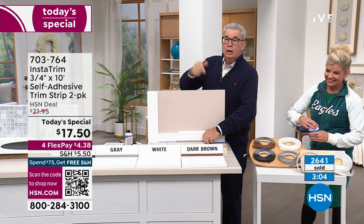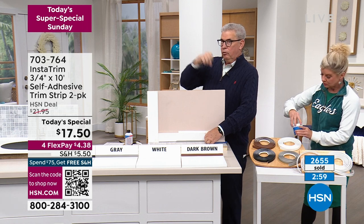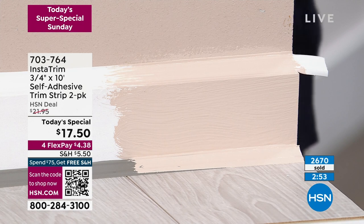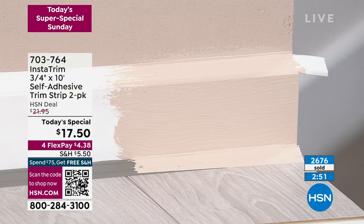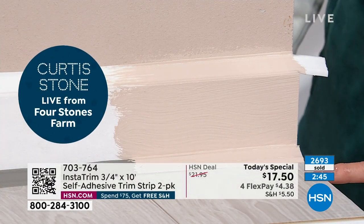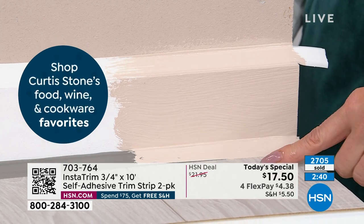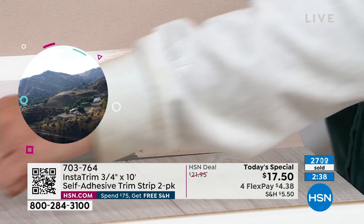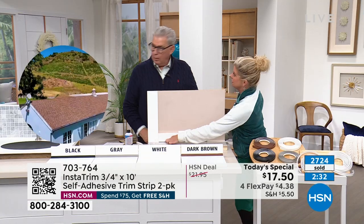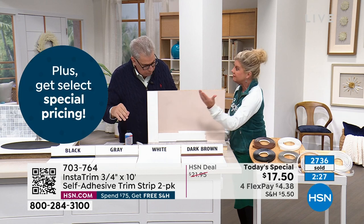Today's paints are just like the Instatrim — they're a film former and they stretch. If you could peel them off your wall, you could stretch them like a rubber band. Always pull the tape when it's wet, because after it dries you're going to take more paint with it. Look how finished that is — you've matched your molding to the wall and it looks so good. That'll dry flat, just like the wall. And come down here if you can relate: I have the exact same laminate floors and it's all cracked on the ends. You can finish that in with the trim, paint over it, or just leave it as is.